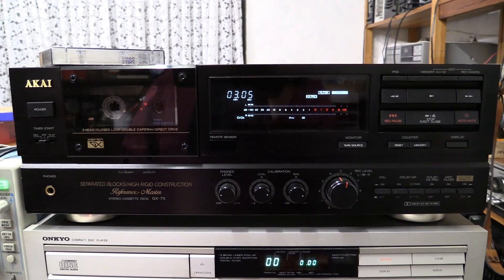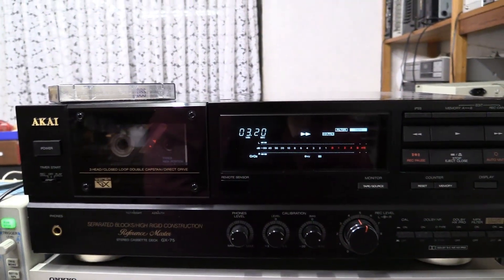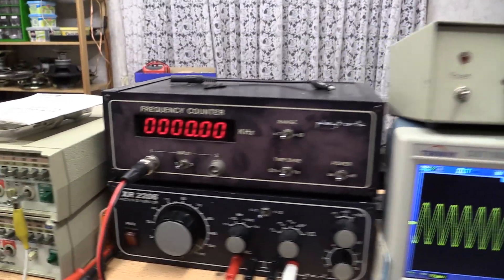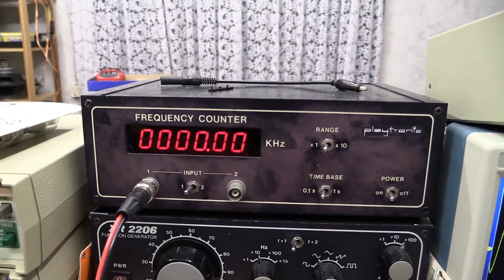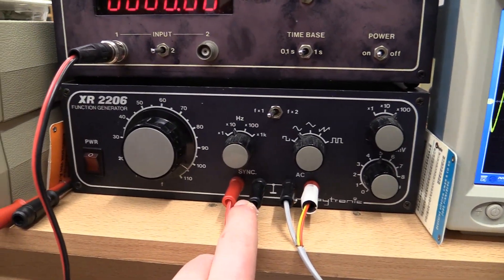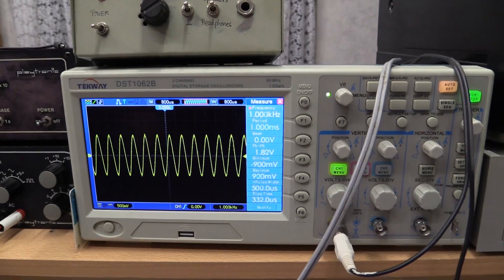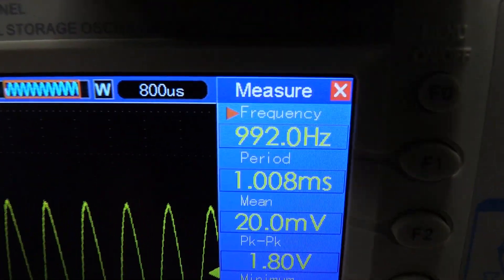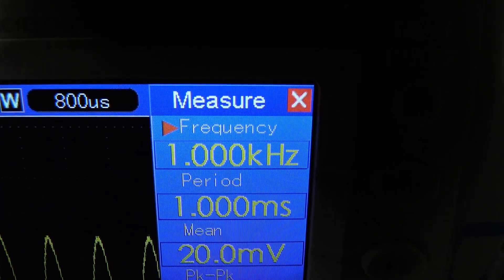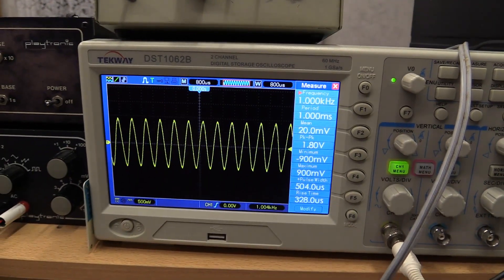Our test cassette has successfully been recorded on both sides. I now have it at a random spot — we can just fast forward a little bit and press playback. The frequency counter won't do anything on its own; it does need a TTL signal in order to work, which this thing does provide. So we're using the scope, which of course has a frequency counter built in. There it is — one kilohertz. It is fluctuating a bit, but the average would be about a kilohertz.